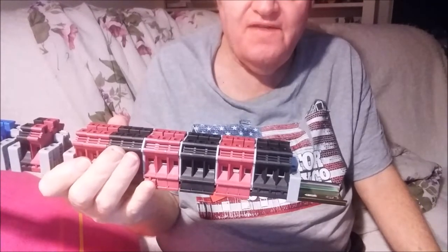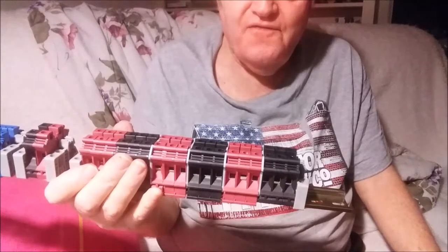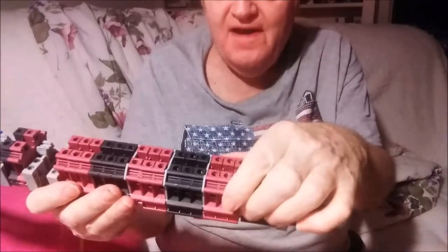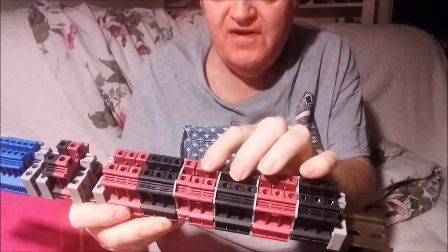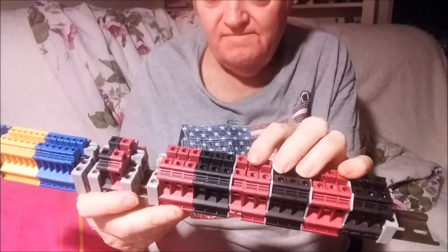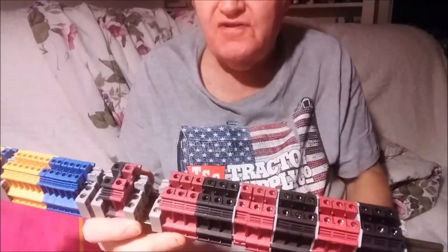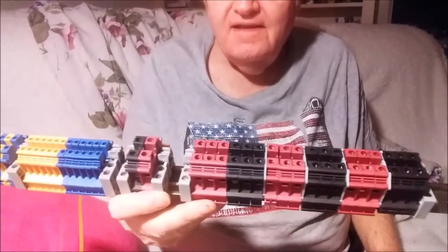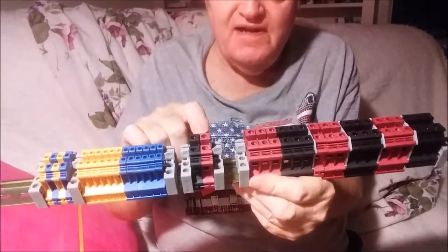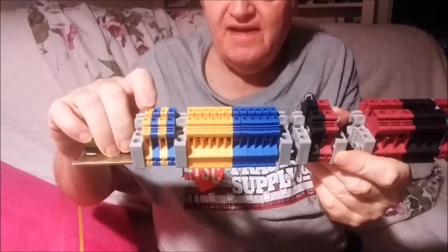You really don't want to put more than 5 receptacles on 1 breaker — I'm mostly looking for 3 or 4. For a pair of 3 blacks and 3 reds, you hook up 5 receptacles. The next group over you hook up 5 of something — it could be a ceiling fan and receptacles, then a third group for more. So you've taken up 3 of your 7 breakers for receptacles.